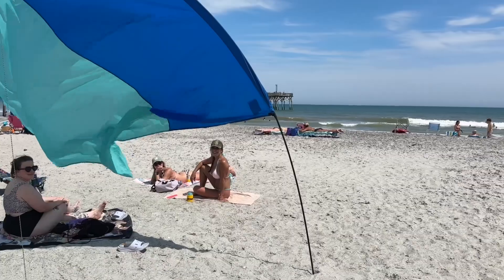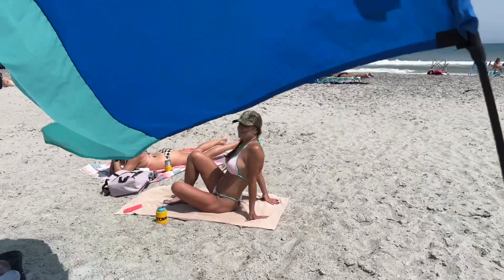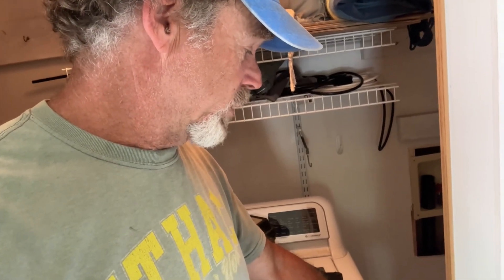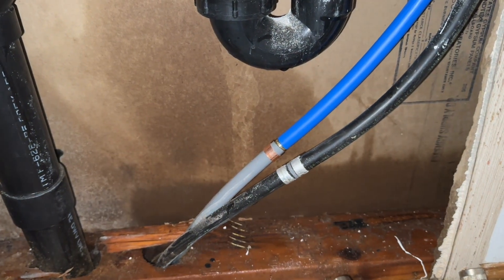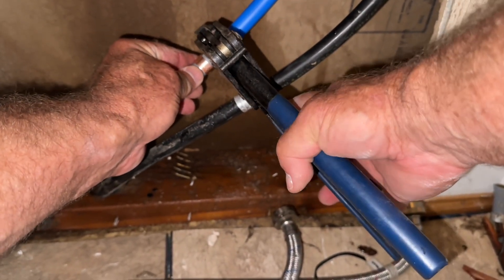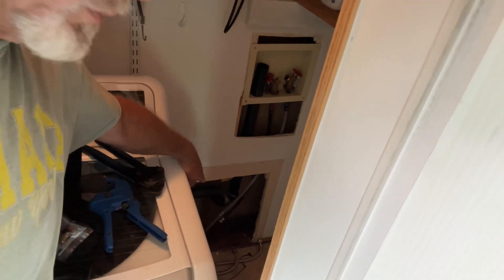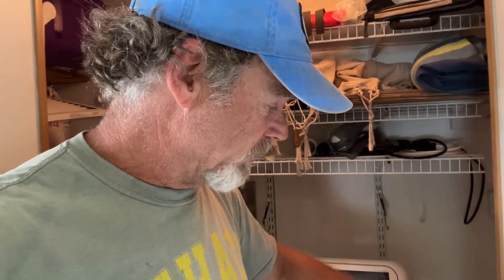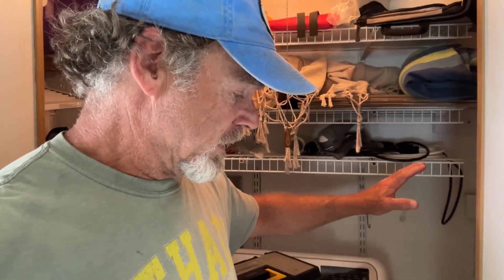Typical — the wife is at the beach with the daughter and I am doing home repairs in a rental unit. I've had one of those nightmare situations with plumbing: the infamous union of polybutylene and PEX pipe. In this case it's polybutylene with multiple couplings, there's a rupture, and worst case scenario it's been slowly misting — not even spraying but misting inside the wall cavity — unknown until some furniture was moved.